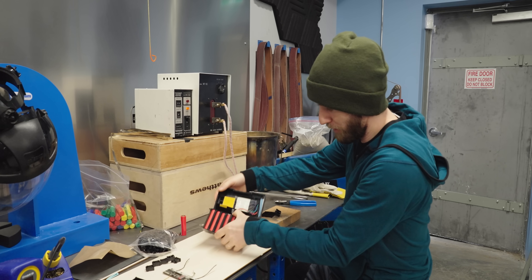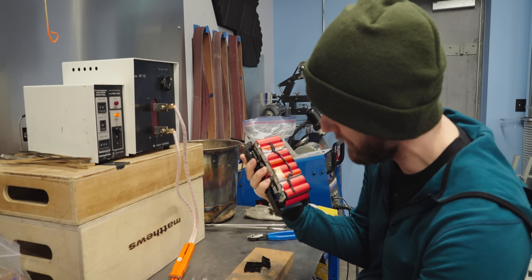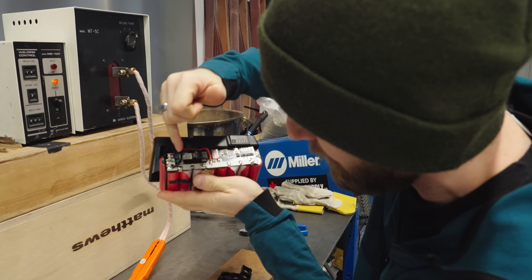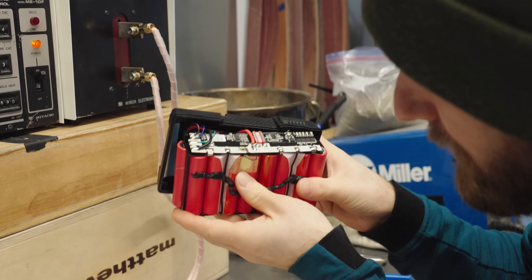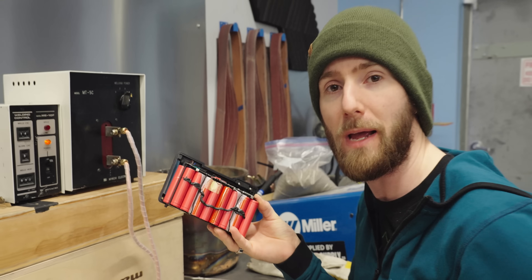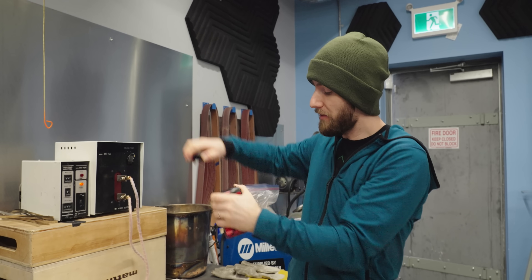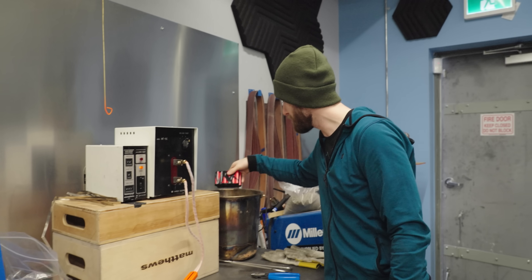Now let's talk about preparation for our pack. Because we have multiples of these red battery packs, we pre-disassembled one so we can get going right away. The process is simple — you just want to desolder the leads running between the BMS and the battery pack, which includes the power leads, the balance charging leads, and the thermistor which monitors the temperature of the pack. One other critical safety measure is disposal of our old cells — cover all contacts with something non-conductive like electrical tape and put it into sand.